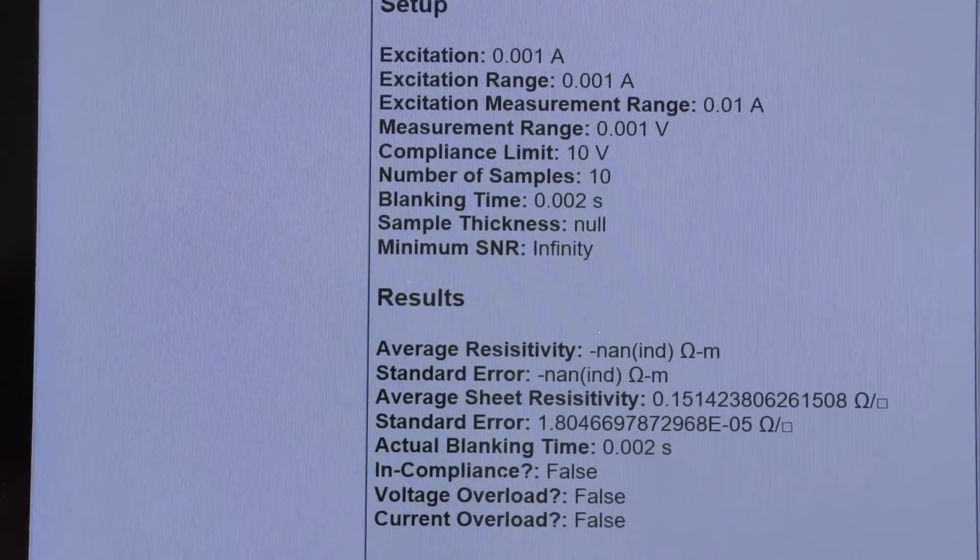Kevin Carmichael on the M91's optimization feature: The M91 has an optimization feature that allows the instrument to calculate the best excitation parameters for a particular sample. This is particularly useful for novice users who may not know how to avoid problems like self-heating. It's also useful for more experienced users with a sample with unknown parameters — they can trust that the M91 will select the best value for them. This is very useful for variable temperature measurements where the resistivity is changing with temperature and continuously needs to be re-optimized.